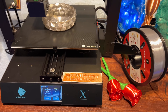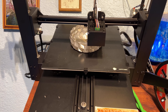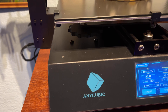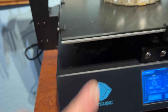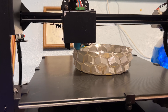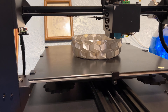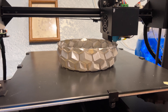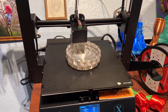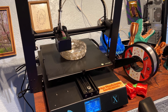Another thing you want to look for is simplicity. A lot of machines will have self-leveling, auto-leveling, or computerized features, but I like having levelers I can adjust manually. When I replace my nozzle, the replacement may not be the exact same height, so I can manually adjust and take the kinks out. Once you get it level it shouldn't change a lot, so you don't need to pay extra for auto-leveling if your machine is set up right.